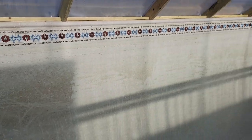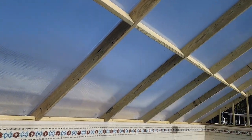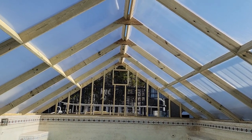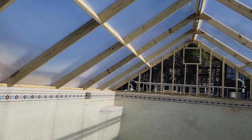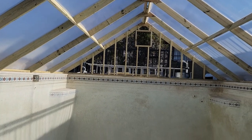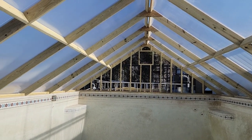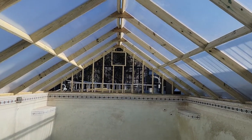These are eight-millimeter polycarbonate panels, 12 feet long. I designed the whole structure to fit a 12-foot panel. In my area of central Texas, 45 degrees would have been the ideal slope for sun exposure, but I wanted to stick with the 12-foot panel length, so it ended up at 35-degree walls to accommodate that.